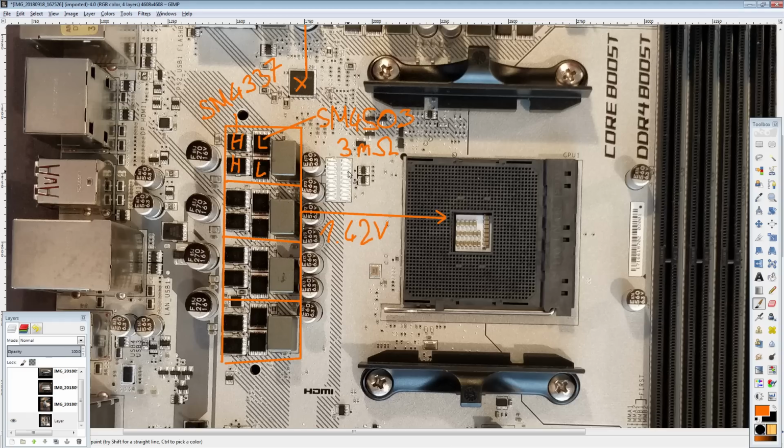On a 12 nanometer process, you would want to stop around 1.38 because that negates most of it. At 1.38, a second gen will pull roughly as much power as a first gen on 1.42. Actually, still a bit more just because they clock higher, but at 1.42, a second gen is really scary hot.